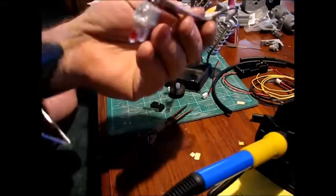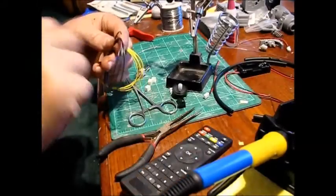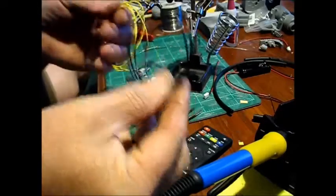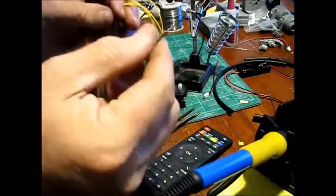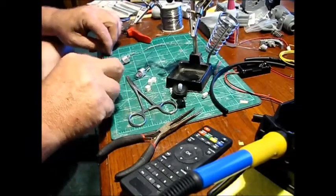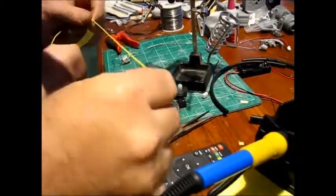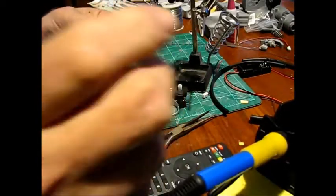After the glue has dried, you can trim it off with a razor knife very easily. You're going to have two different colored wires in your kit. The difference isn't the color that matters, it's the weight of the wire — the heaviness. They're 24 and 28 AWG wire. Take the heavier of the two and cut two pieces ten inches long and one piece nine inches long. Then for the thinner wire, cut two pieces about three inches long and two pieces about two inches long.